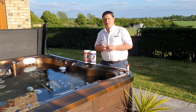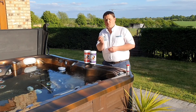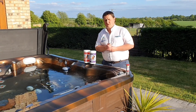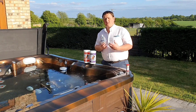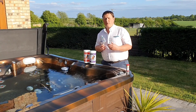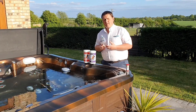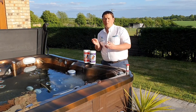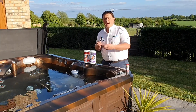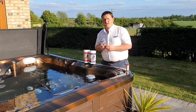For the next video we're going to look at balancing the water. Our pH was slightly low and our sanitiser was okay. If the pH is low, the water is acidic and it's going to do a lot of damage to our hot tub and burn off our chlorine or bromine very quickly. If the pH has gone very high, that's going to make the water extremely scale-forming and it will reduce the efficacy — the efficiency — of the sanitiser in the water.